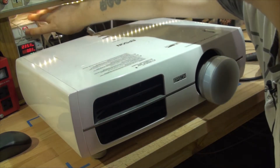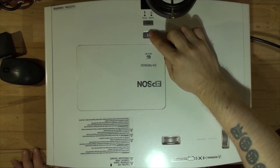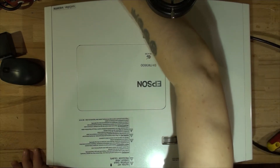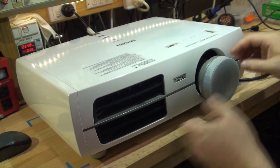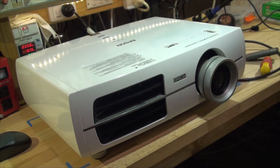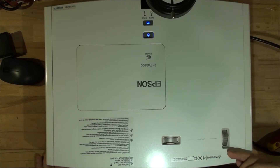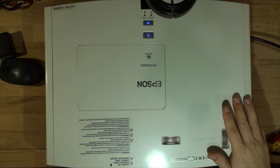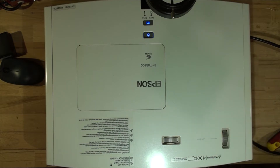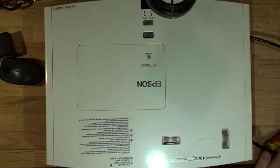I've got it through current limiting — zero watts. The light came on so I'll turn current limiting off and try to strike the lamp. I can hear the motors inside for the iris; the lamp isn't striking, however the fans are not working either. It's consuming 26 watts at the moment and I keep hearing this little iris. Anyway, I'm going to turn that off and open it up — I'll show you around the projector first.